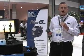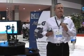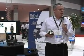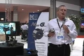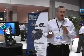First is self-positioning of the knives as they're clamped in the head. Traditional insert knife cutter heads have always had the need of the human factor to set them in place and hold them properly. With this tool now, we have self-positioning of the knife, so it speeds up the knife changeover and provides a higher degree of accuracy once the tool is running.